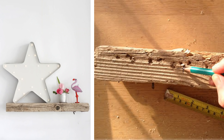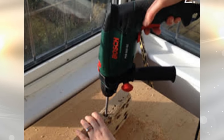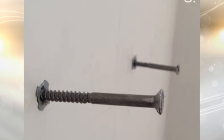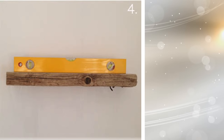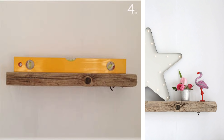10. This floating driftwood shelf looks great in your bedroom, where you can display anything on it depending on your bedroom's theme. First, prep the wood by cutting to the correct length. Drill the holes in the wood and make sure you drill far enough to make the shelf secure. Mark on the wall, drill it using a normal drill bit, hammer in the wall plugs, and then screw in your long screws. Keep checking the length of the screws against the shelf as you want it to sit flush against the wall. It's so handy for displaying bits and pieces at your home.